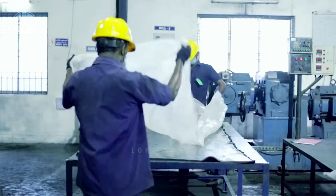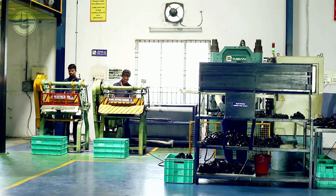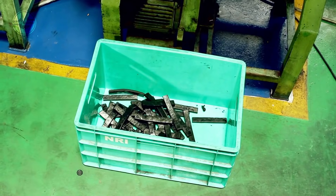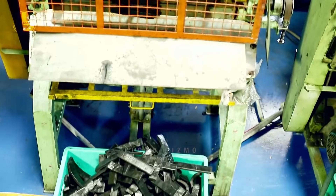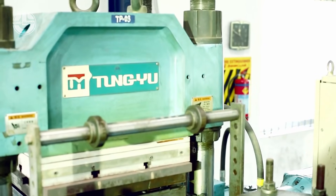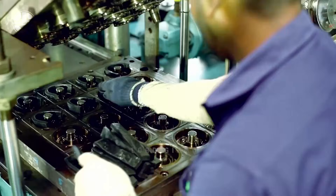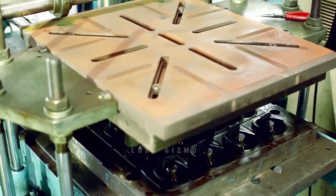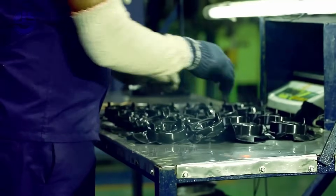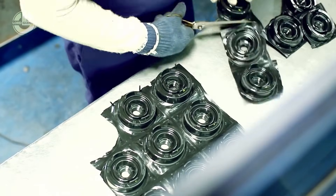Once the sheet is flattened out, they will be rolled together to transfer onto cutting machines. They are cut to a certain size and shape, depending on the end product. The rubber compound is compressed in a mould under pressure and heat to form the desired shape, whether it is gaskets or seals. This can be compression moulding, transfer moulding or injection moulding. Once that is done, they will go through a series of inspections and quality control. This will be the final step before a wider market distribution.